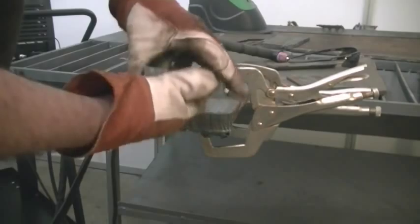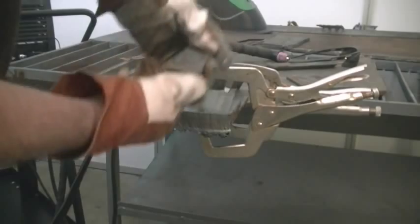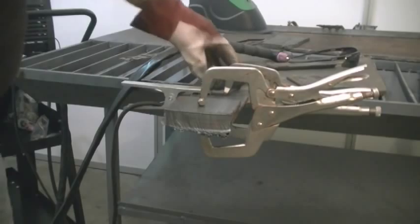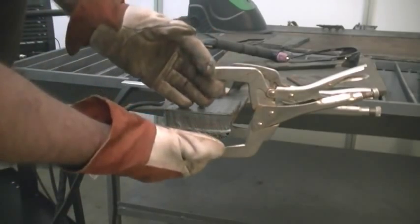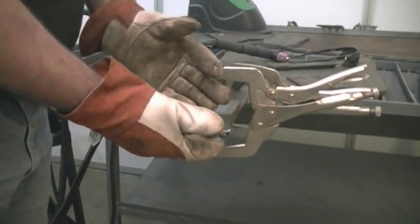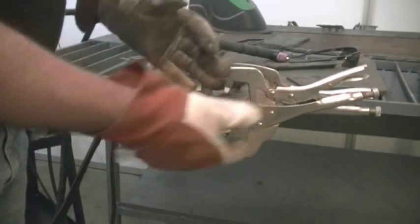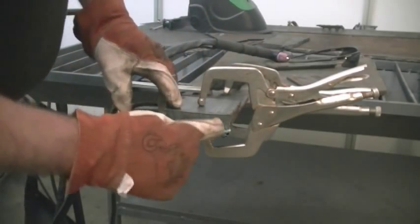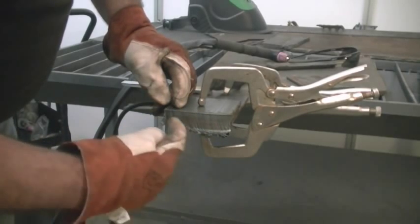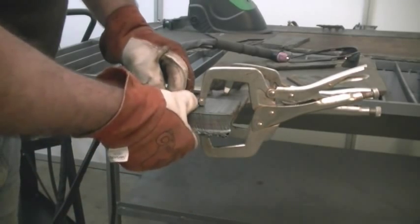Here's the result — one, two, three, four pieces of metal that were cut at one time. This is a full cut. The machine is rated for one and one-eighth inch cut, which is very easily doable with just a little bit slower speed. You've got a really nice clean cut here. The drag lines are very good, though toward the bottom they start drifting off toward the rear of the cut — and that's normal for a machine reaching its capacity cut.